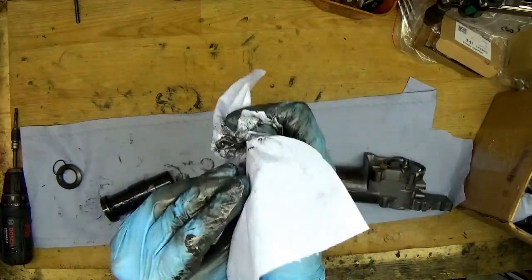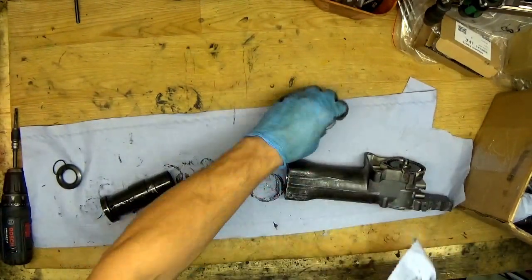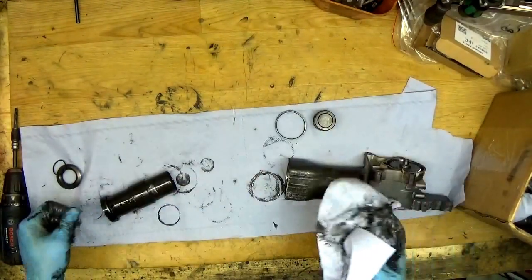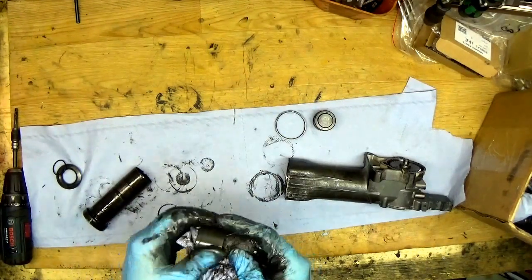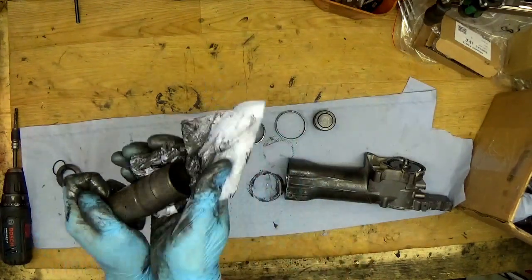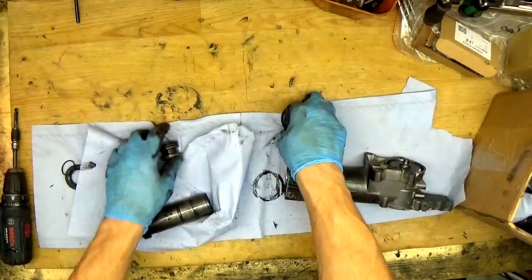We can see that the O-ring is getting flat, so that means it's going to affect the compression side, so it will not work properly. Definitely we need a new O-ring. It's a rubber here, so checking it for cracks is good. Okay, the tool holder. The cylinder. Yeah, it's nice. Wrapping this in paper.